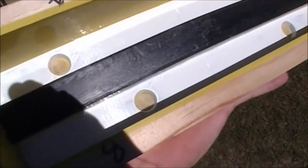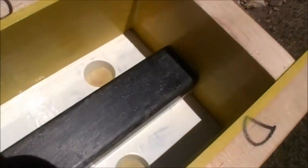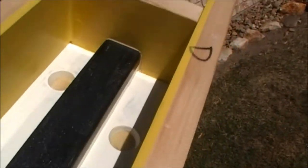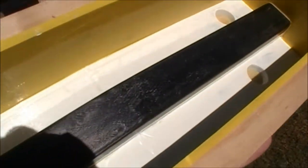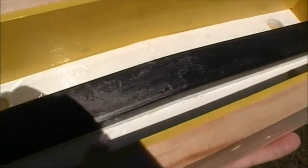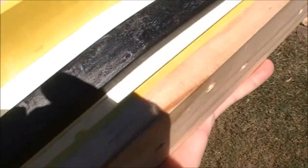Okay, this is the underside of the mould now. I don't know if you can see, but the button holes I have partially filled with plasticine. A little tip I picked up off Jeff. That way if any crap gets in there when you're actually making components, it doesn't hold the moulds apart. So there you go. She's all waxed, just ready for PVA, and then we can pour the second side.